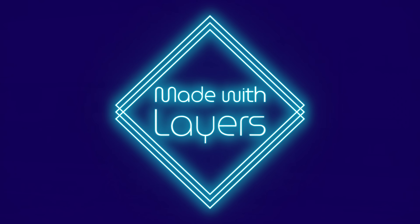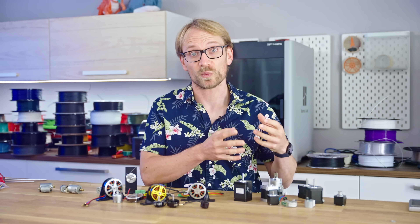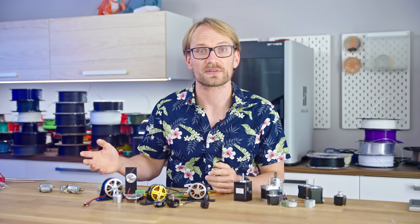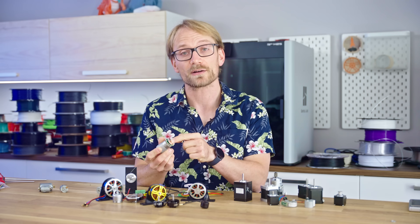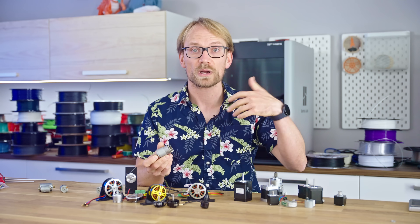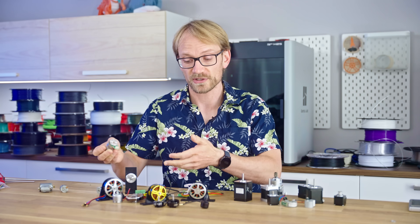I've had a look through some forums on the internet, and there seem to be a lot of misconceptions about what a servo is and how it relates to stepper motors, brushless DC motors, and brushed motors. Any of these motors can be a servo, as long as it has a way of measuring its position and using that as feedback for how the motor is controlled. And once you have that position feedback, you can also use it to control the motor more efficiently.